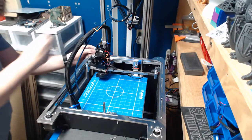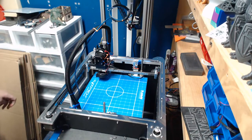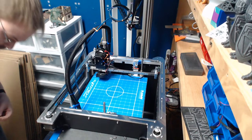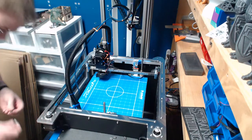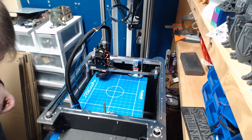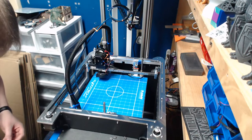There we go. Hey, look at that. Very little play, spin smoothly. That's one. Okay, so on this, I happen to know, this is my 20 millimeter. I know I want one shim above. I want a tooth idler. That one feels pretty good. One shim.